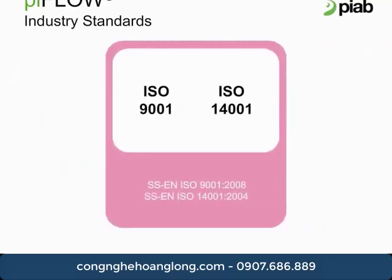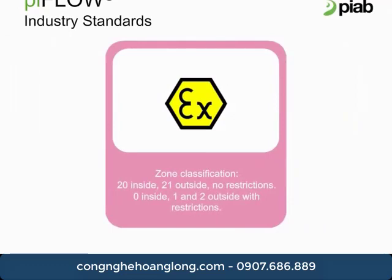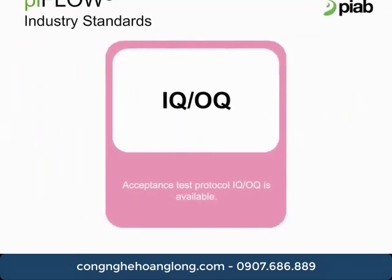Piab AB is certified by a third party according to ISO Spec 9001 and 14001. Piab vacuum conveyors I, F, and P can be certified for ATEX dust. The piFLOW P can extend to gas ATEX certification. IQ and OQ packages are available for the piFLOW P. IQ is installation qualification, and OQ is operational qualification. Typically, this document package is used for pharmaceutical companies.